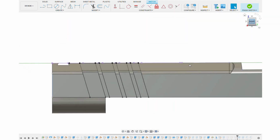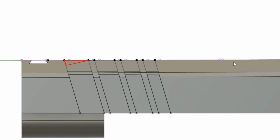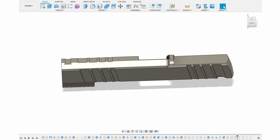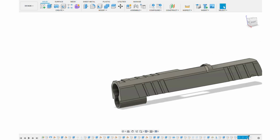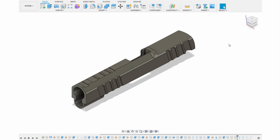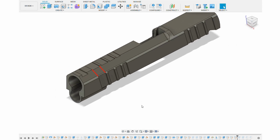The width of the top cut is the hypotenuse of this right triangle, so they are all slightly wider than the end mill size of their respective side serration. The location of the front and top serrations was based on about where I thought I would be gripping the slide. Then I modeled up the front sight and checked their position in relation to that. I didn't want to connect the serrations across the 45 flat. It would greatly increase machining time and difficulty. Any little mismatch in location where the lines meet at a corner, even a few thou, the human eye will generally pick that up. This design was about as complicated as I wanted to get while still being reasonable for me to machine, even though it would take multiple setups and tool changes.